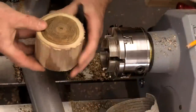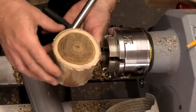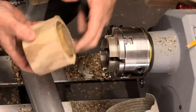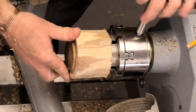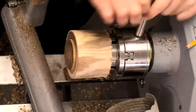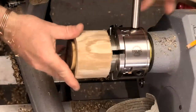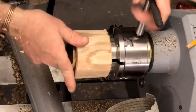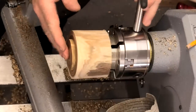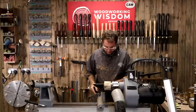Not too much. The top — I'm looking at the white sap around the edge, more of a constant band. If I flip it over it's a little bit thinner on this side. Let's have this as the top then, so that white sap will hopefully look more constant all the way around that lid. Just checking where we load — I've got a little bit of hand pressure, not quite pushing equally. Okay, we can go with that. Let's do it up. This is the 100mm chuck.